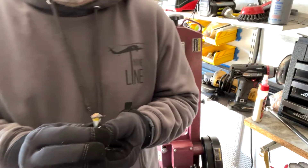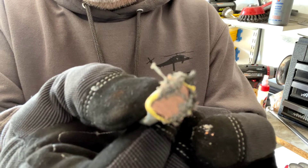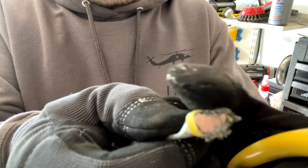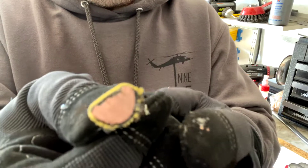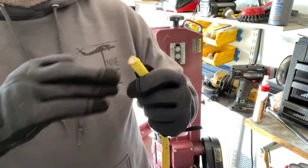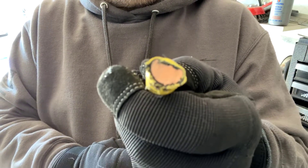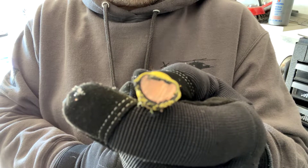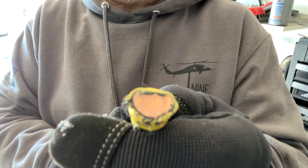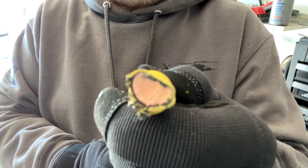Alright, let's take a look. What you can see is it appears to be one solid piece of metal at this point, and that's what the crimping process is supposed to do — supposed to crush all those individual strands down to where they become a solid piece. This is the lug end, this is the cable itself that is crimped, and I think that looks pretty good. A lot of positive pressure gave me a fully seated cable and a completely crushed and unified band of copper strand.